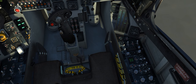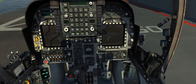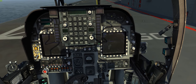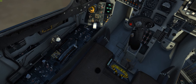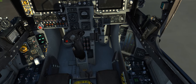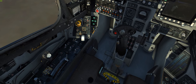So for this I'm going to switch the engine into on, and what's happening now is the revs are going to go up to about 92, and this is enough revving of the turbine. This is driven by an electrical motor, and it's just enough revving of the engine to allow the engine to pick up its own pace when we inject fuel from our throttle lever here. So we've got to wait until it steadies out. Everything else is good. The only item here is the generator, because we don't have enough power in the engine to generate electricity for the aircraft. That will happen when we spool up our engine.